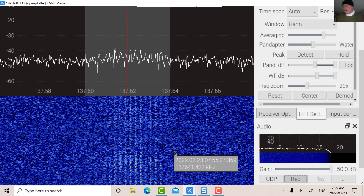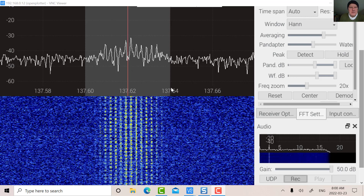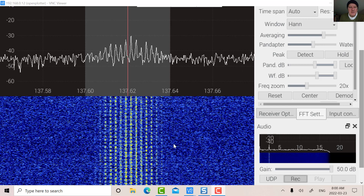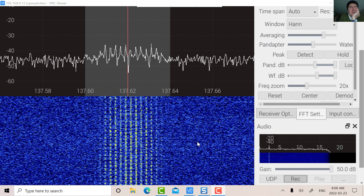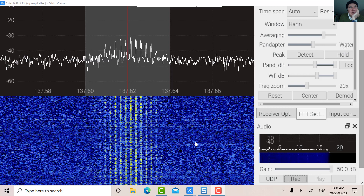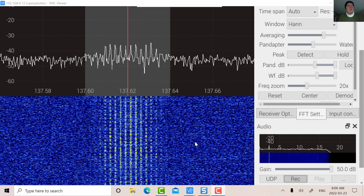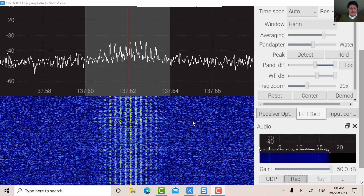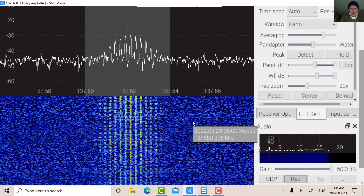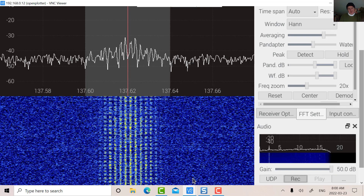About weak, actually. We're getting a fairly decent signal now — these sidebands are fairly strong. You've got a strong 2.4 kilohertz and we're seeing most of the sidebands. I look east here from my QTH and there's a fair amount of obstruction with buildings, so the elevation has to be bigger than 15 or 20 degrees, otherwise I won't see anything — it'll be blocked by the building. So the first part of the pass was blocked because of the buildings; the elevation was like 10 degrees, it was too low. Right now the elevation is 18 degrees, so that's just the limit. We're getting a strong signal now.